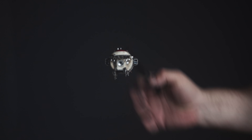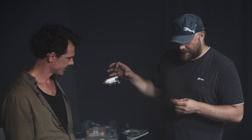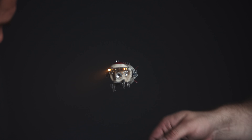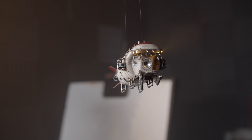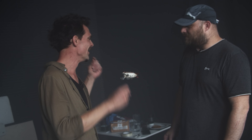We don't have an exterior switch, so we don't want to touch it — as little as we can — because if we do, it's going to wobble for about an hour. So we're going to use a reed switch, which is a handy way to activate the lights remotely without touching the model. The way this works is it uses a magnet to open and close the contacts on the reed switch. A magnetic switch — these are the things that are so necessary when you're dealing with a tiny model on tiny wires.